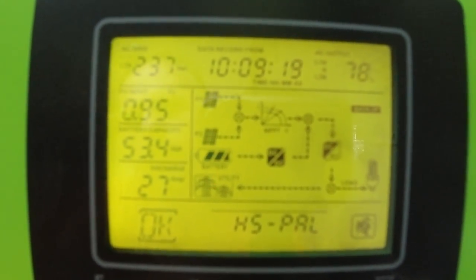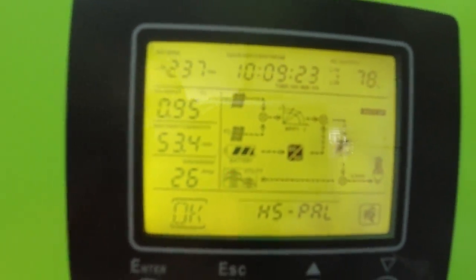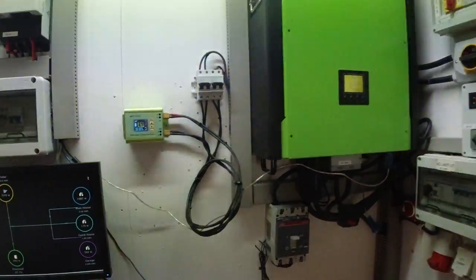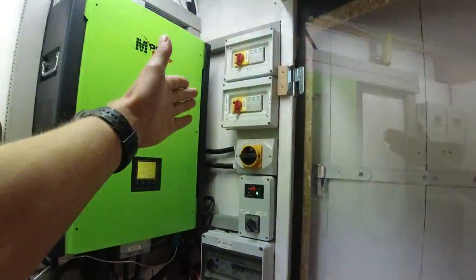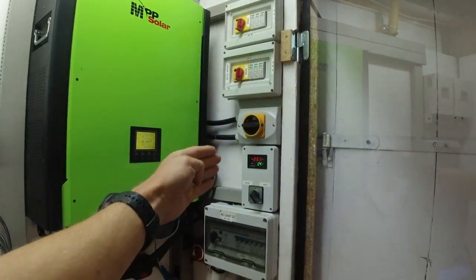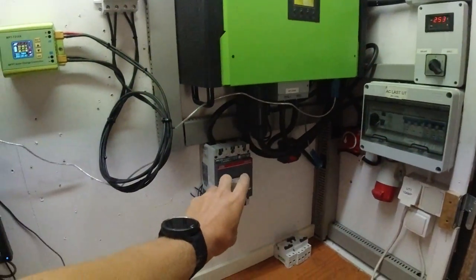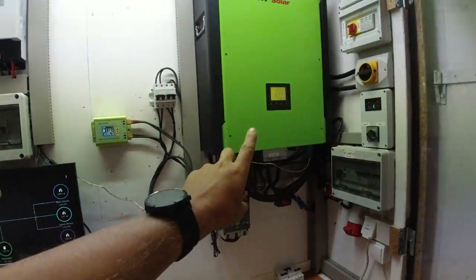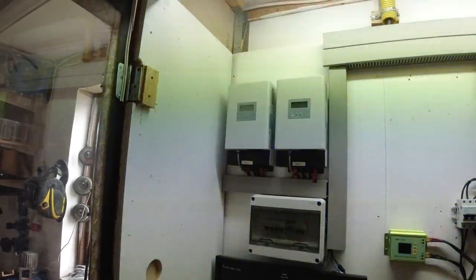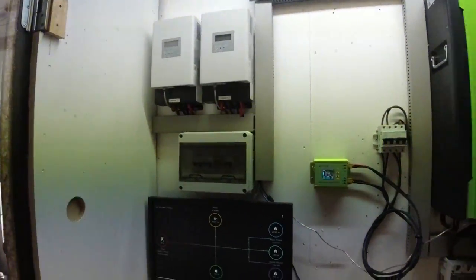I'm maxing out around 80% out of the inverter currently, which is pretty much at capacity. The normal setup has PV incoming, the grid connection part, AC out, and a secondary AC out. I have an ABB shunt trip managing this green machine, and the PCM60X is running just fine producing a lot of wattage.